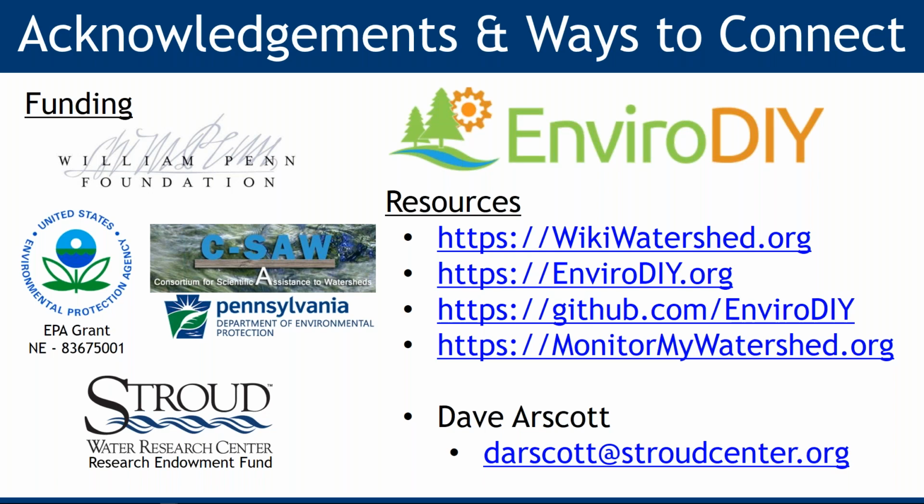Well, I guess I would just follow up that the data logger part that communicates with the network needs to be exposed so that it can communicate in real time. However, the Mayfly data logger also has onboard SD cards, so you don't have to utilize the real-time aspect. You can log your data right to the card and then retrieve it and download those data.